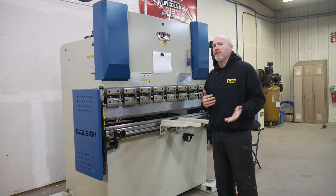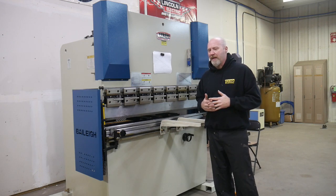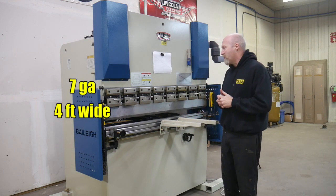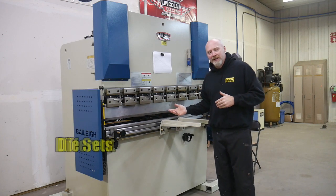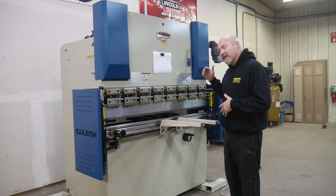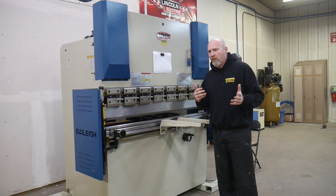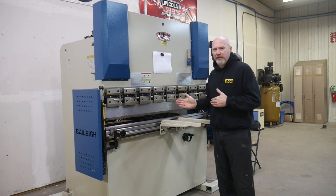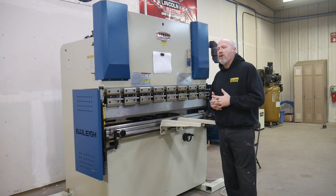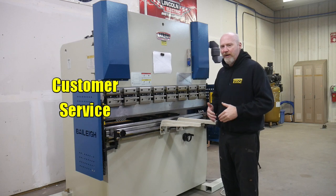The other big thing was making sure we knew what size press brake we wanted, so if you're selecting one make sure you really understand that. Our requirement was to be able to form seven gauge, four feet wide. With the different die sets available, that came out to about 28 tons, and this is a 33-ton press brake — so it was within the window. Bailey also appeared to be a reputable company, and we wanted to make sure we were buying from someone we could get support from if we had any issues.